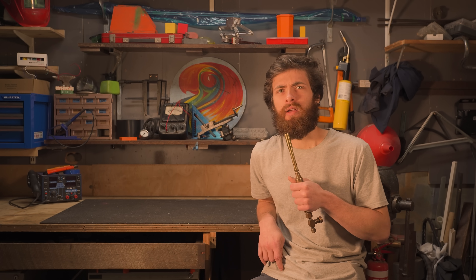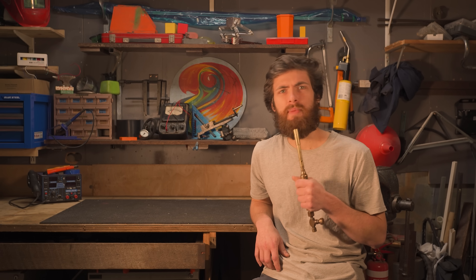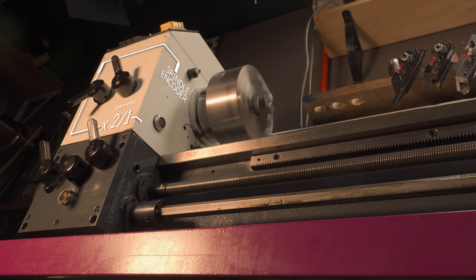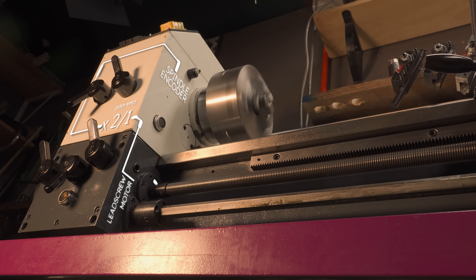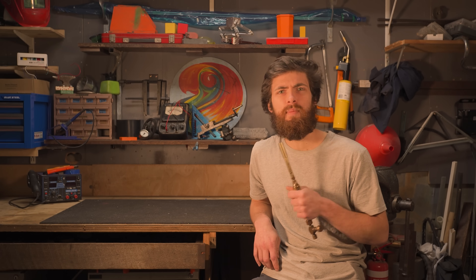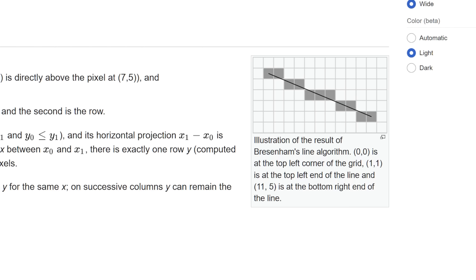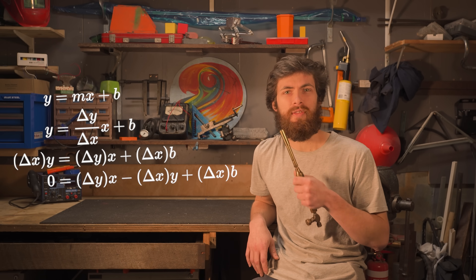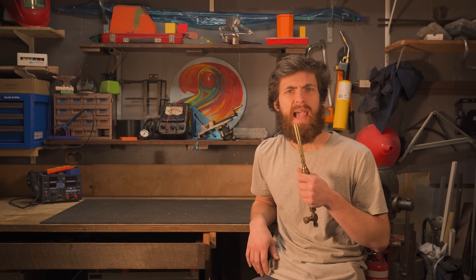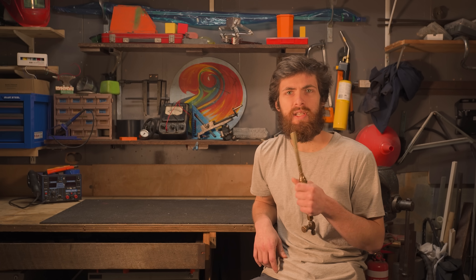The next challenge was converting that encoder input, or pulse count as the kids are calling it, into step pulses for the motor. This is easy peasy when your ratio is something nice like 2 to 1, where you can just send 2 step pulses for every encoder pulse you receive. But when you need some rare and exotic ratio, like 2 motor steps for every 5 spindle pulses, you have to do some pretty clever maths. In my search for code to copy — I mean while I was working on this problem — I came across a solution known as Bresenham's Line Algorithm, which is commonly used to approximate straight lines in a digital space. I somehow managed to distill the concept into a little bit of logic that can determine how many steps we need to send to the motor for any given pulse and feed ratio, without having to deal with any pesky floating points.